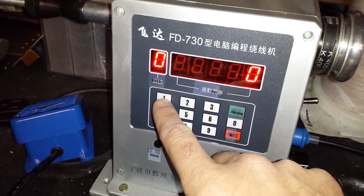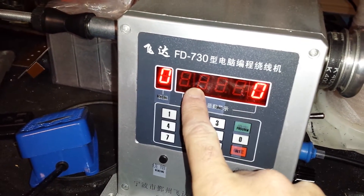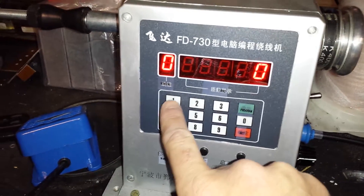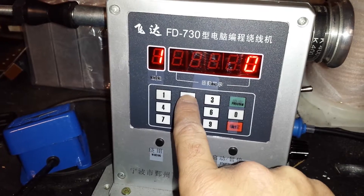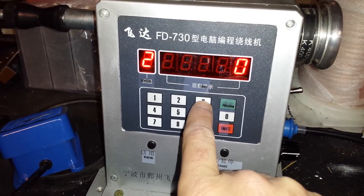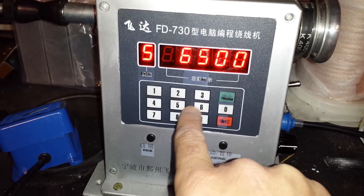For example, if you're winding a transformer and making lots of the same one, you could have up to ten windings numbered zero through nine with the number of turns for each pre-programmed. In my case I'm making guitar pickups, so I'll have a few different programs. Pushing the program numbers flashes up the pre-programmed turn count — one is 3,300, two is 4,000, three is 4,200, five thousand, and so on.